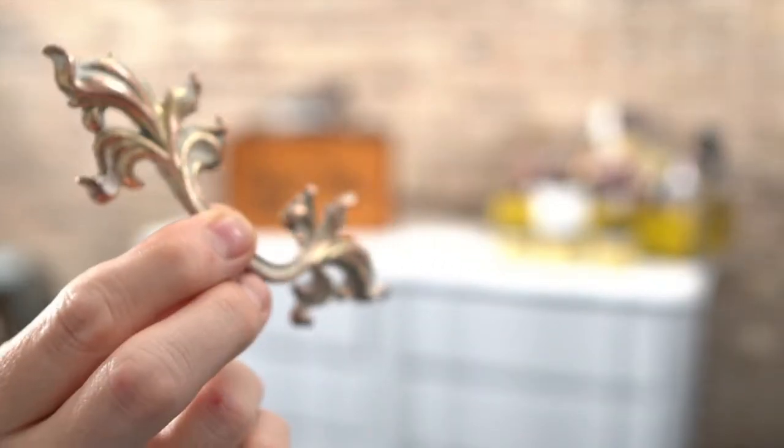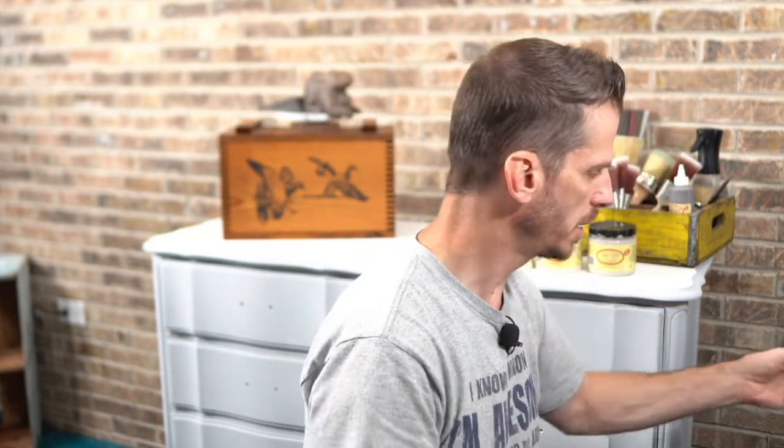It has a little bit of a copper look, but the white paint is gone now — that's the original color. That's how the hardware looks. You can imagine comparing it to the way it originally looked — I really had no chance of getting all that paint off without boiling it. So that's how I clean hardware. This could be hinges, anything with caked-on latex paint on metal — that's the technique I use. I've got a few ridges here and there where I'll take maybe a little X-Acto knife and pick out any stubborn last little bits. My hardware is all ready to go and looking good — it might be good to give it one more general cleaning, but those are good to go.